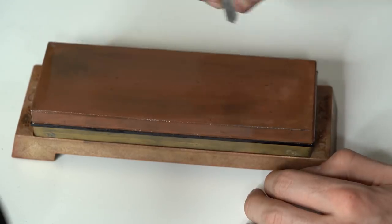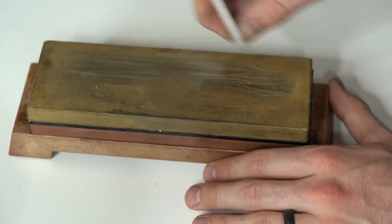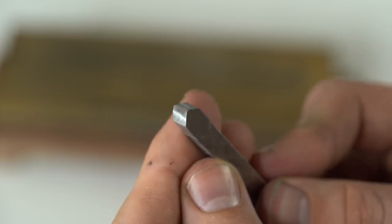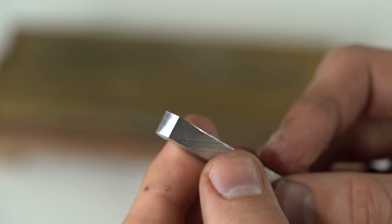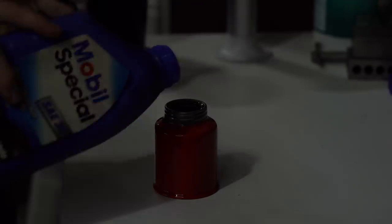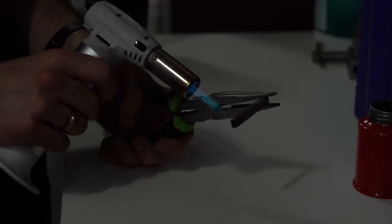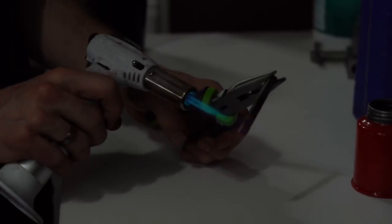But the challenge is that you need the steel on the chisel part to be hard enough that it will actually impact a good clean line. And if it's too hard, it's going to chip off on you. So you've got to be careful, and there are a lot of different techniques that you have to experiment with. I was doing a lot of different stuff off camera on a scrap piece. Eventually I was able to get it down, and it wasn't perfect, as you will see, but it is a functional file. So I was really proud of that.